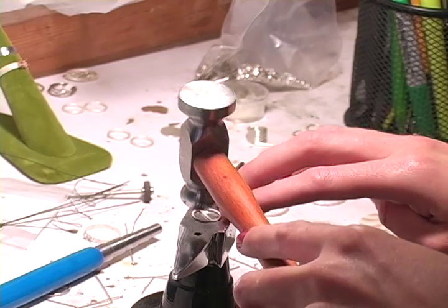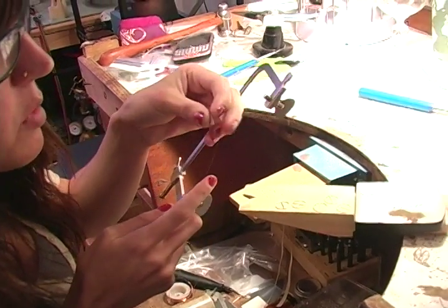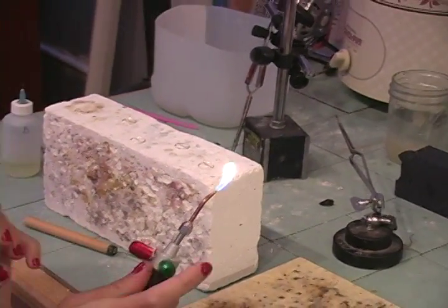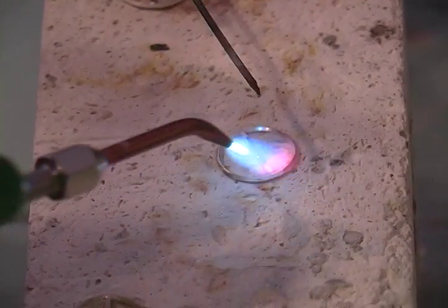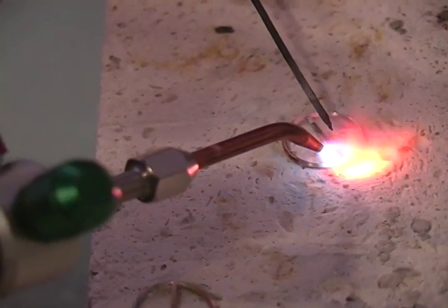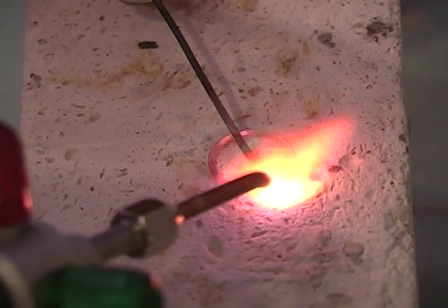I use a lot of different tools — a lot of different types of hammers. I have a rawhide mallet which I really like, and a bunch of different hammers that are different sizes and different shapes for building texture on the silver. I use a saw and also a little torch, and those are probably my favorite tools. I have a little anvil that I use to hammer on. I use an oxygen propane torch — it's a tiny torch but it still gets really hot, and it's great for soldering silver and annealing it, which is heating the silver so it gets soft and is easier to work with.